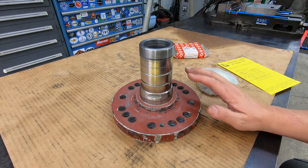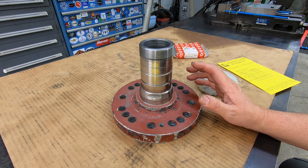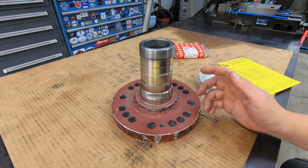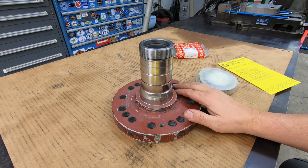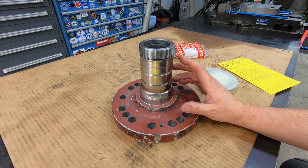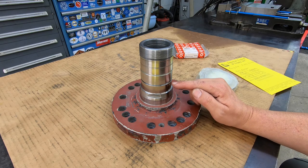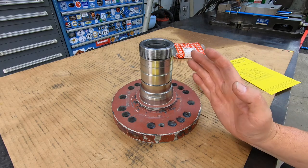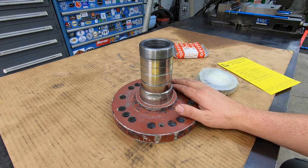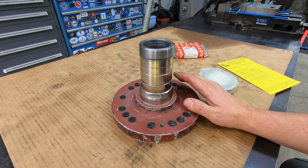want to go over there and start arc welding on shafts. It causes it to warp and bend. That's the benefit of using the Eutectic powder and the thermal flame spray process. It minimizes the heat that you're putting into there. When you compare it to arc welding, you're putting a lot of intense heat on a part, and you're going to cause it to warp or draw one way. The flame spray is considered a cold process because of the heat that goes into it.